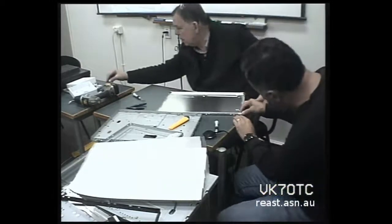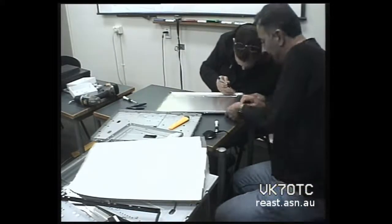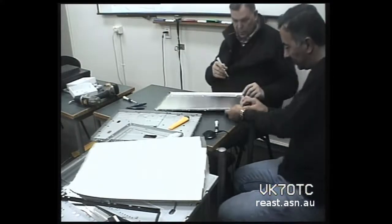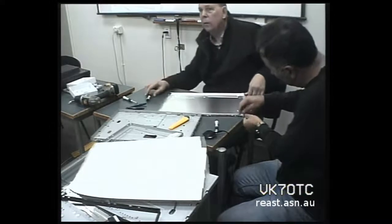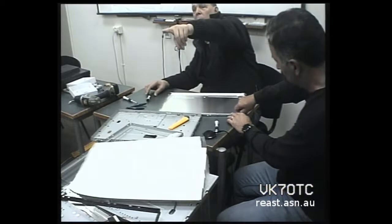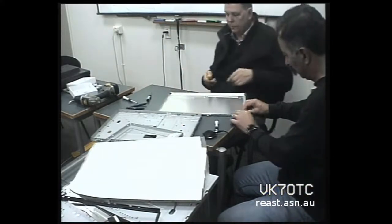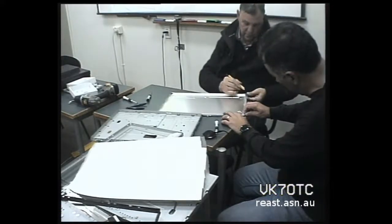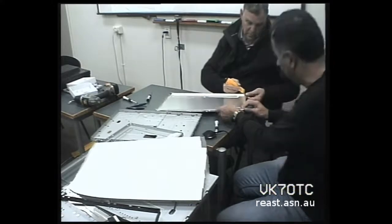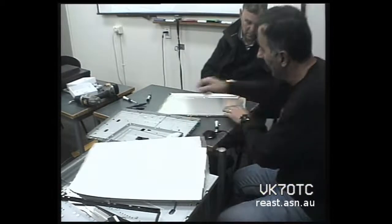What have we got here? I don't think we need to undo those screws. I don't remember us doing that before. There's tape around there, that white tape. This is the same problem with ordinary fluorescent lights, that you don't want to break them. But this is 10 times worse because they're about 1/8 of an inch in diameter tubes, and they're very fragile. There's two of them and they're really fragile, and it's so easy to break them, and then you end up with shards of glass.